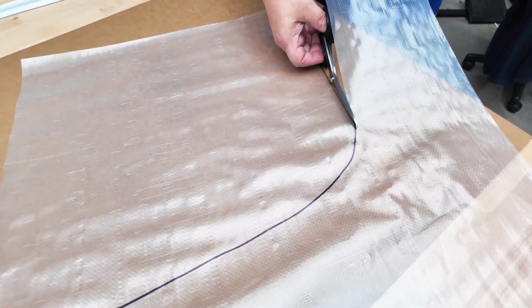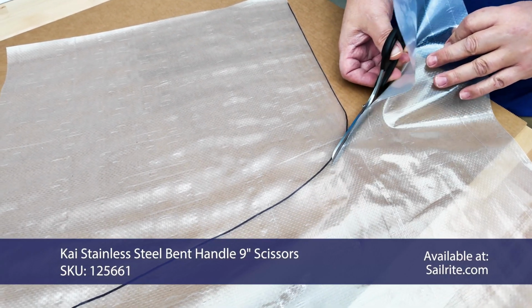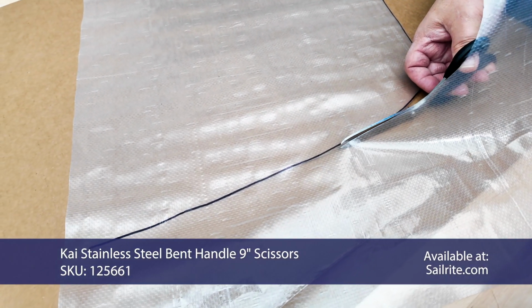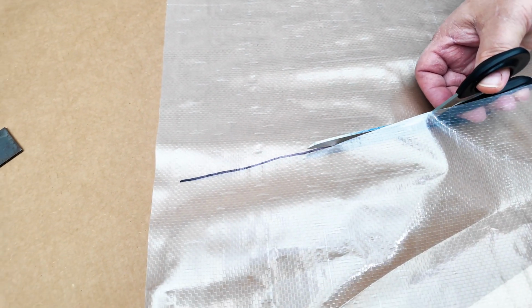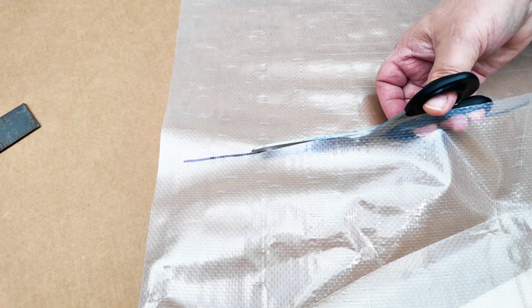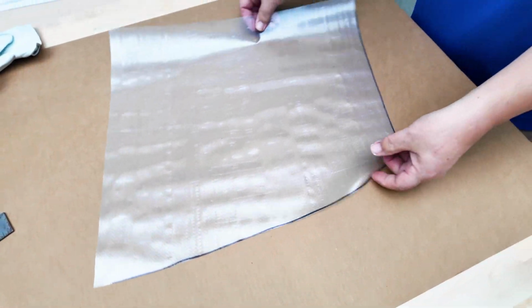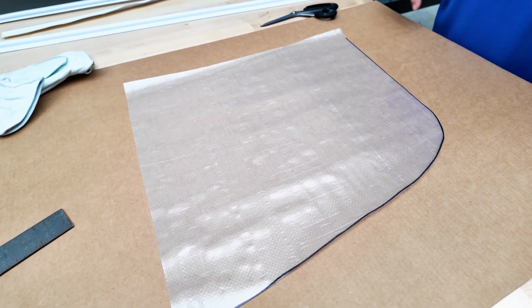We want to cut out on the pattern material what the bend is for the awning track that we want. And then we want to transfer this onto a piece of cardboard, because if we try to heat up the awning track on our pattern material, it will melt. So once we've cut this out, we'll transfer this onto our piece of cardboard with a marker.